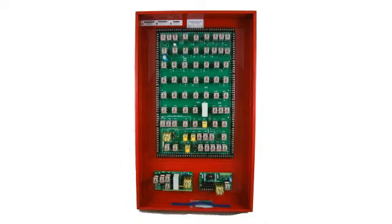Okay, and this is what the panel will look like. Here's your main panel. Now mounted in this panel below, I see a nudging unit and what we call an ACX unit. ACX is just the way we control an AC door operator. We're able to slow down an AC door operator within code requirements without putting a VVVF drive on the motor, and that's the way most people do it. We actually have a small board that can control the old Otis AC operators. And by doing that, we save the building and the company a lot of money.